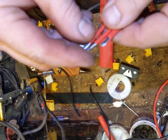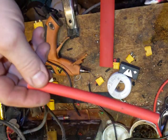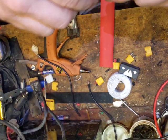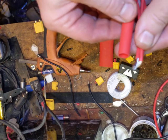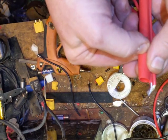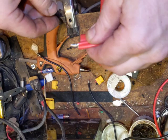What you can do is bundle these together, then use your heat shrink to keep them together — to band them essentially. Maybe use about that much heat shrink. I'm going to add a third wire to this, and then it'll be heat shrunk before I even start soldering. That way it'll keep these wires mechanically together as I solder them and connect them.